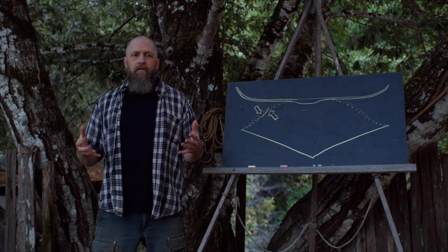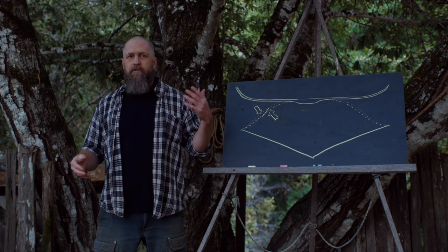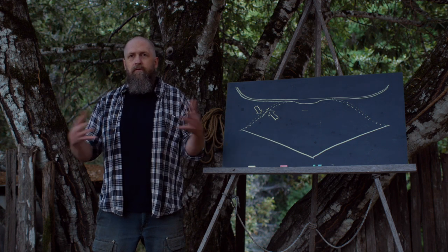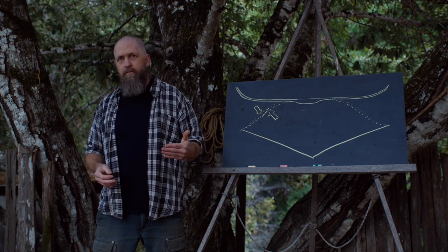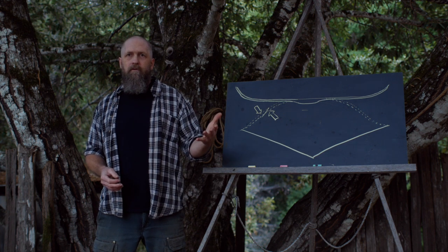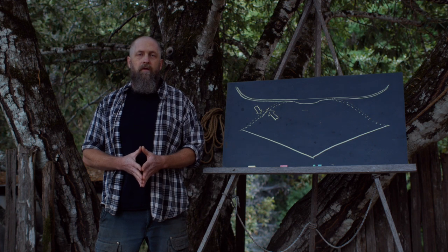It's important to keep in mind that theory versus real life is often a difficult tangle to sort out. I might be missing something, some information I don't have, something I haven't thought of. We make decisions based on limited information and experience. Maybe that hardened shell on the outside of the axe handle serves some good purpose. But given my information and personal experience of charring wood and finding it very brittle and breaking easily, it's going to be hard to convince me to take a torch to the outside of my axe handle and compromise it in terms of resilience to stretch and tension — for essentially what good reason?